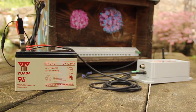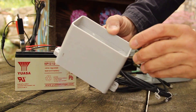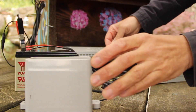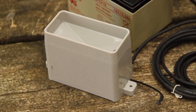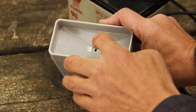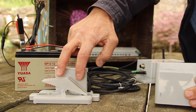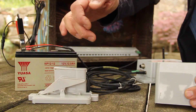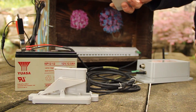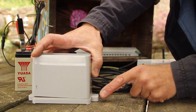We can monitor weather conditions using our weather pack. This is a self-emptying rain gauge that also has a sunshine and temperature sensor. It has a spirit level and needs to be mounted relatively level. Like the battery and bee counter, it simply plugs into the gateway. For maintenance, if leaves collect in the funnel they can be cleaned out periodically. The self-emptying rain gauge works with a bucket that tips from side to side — insects can sometimes build a nest inside, so on a bi-monthly basis it's a good idea to unclip the top and check that the bucket is free to move.